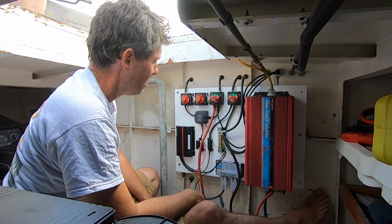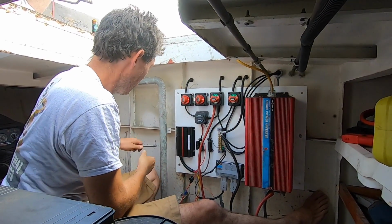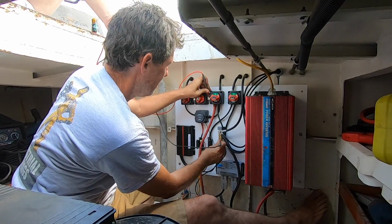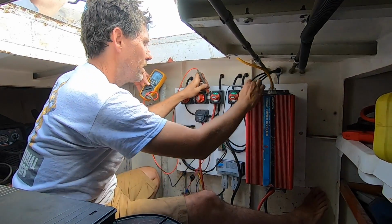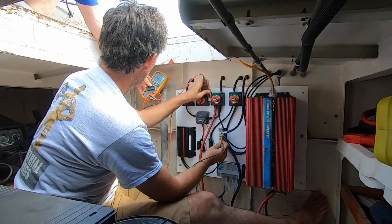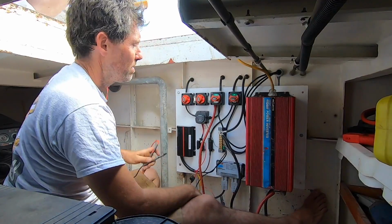Well, the trouble is we didn't test it before it powered up, so let's just switch it off for a second. Off here. Yep. I really don't expect much. So just here and here. Those terminals, yes. We'll just go to DC. So we're at 26. 26. And on. Cool. And yeah, 25.3. So that's mostly going to be battery voltage drop anyway. Okay, cool. Perfect. That's what we want to see. Nice.